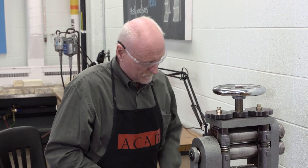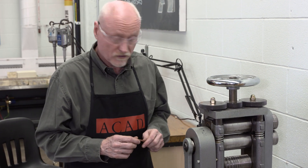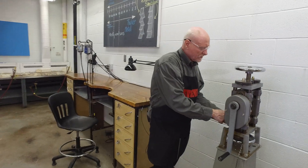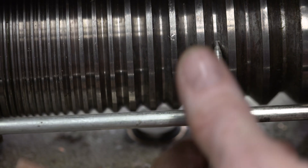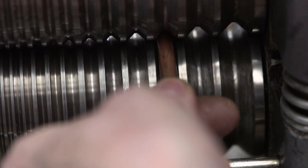At this point we'll take some metal. I've got a rod here — it's bronze in this case, it could be anything. I'm going to set this needle here at the back which will let me know which hole I was last in. Now on this one I'm going to begin with a fairly large hole, and I'm going to insert the rod into the rollers and then 90 degrees in the same hole.